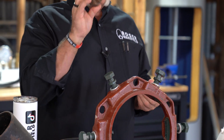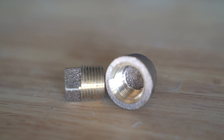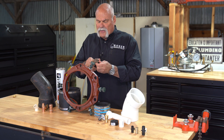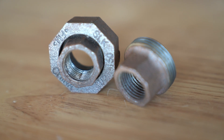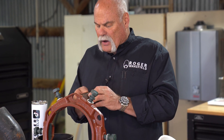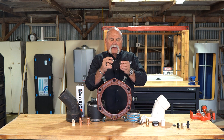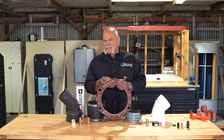These are different type fittings. I've got a black union here, I've got a brass cap and plug, and I've got a PVC plug. They're all a lot different, but they all connect the same — they all connect through a threaded connection. The union is where you have to join two pieces of pipe together and a coupling won't do it. You've got two pieces that are already there, they're threaded, and you need to connect them. You screw one piece in here, screw one piece in here, line them up, and tighten them up. On the inside of this union, you've got almost like that flare connection we just talked about — a male and female side where it goes together and seals it off. By tightening it up, that's what actually makes it seal and hold.